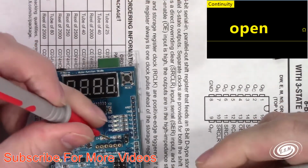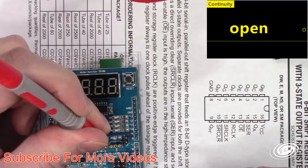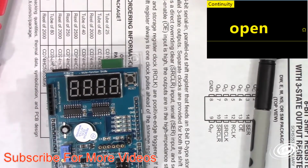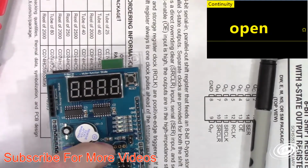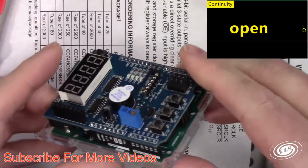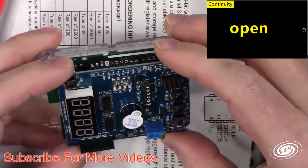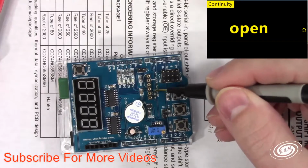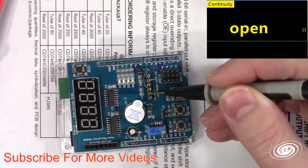Let's further investigate this. Yeah, so this one was ground, and this one was positive. So if it's a module you clip in that has 6 pins, I don't think that would work. Now, I use a rotary encoder for a lot of projects. And I wonder if you could plug in a rotary encoder. Let's see if there's 5 volts on this Bluetooth module, because there's only one digital pin on here, and I need 2 or 3 digital pins to plug into.